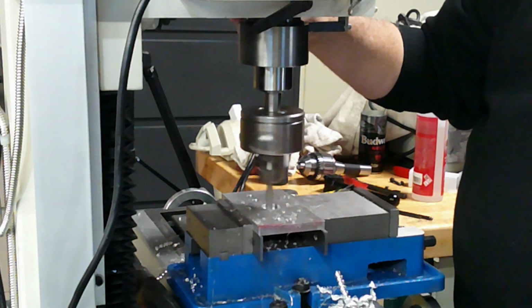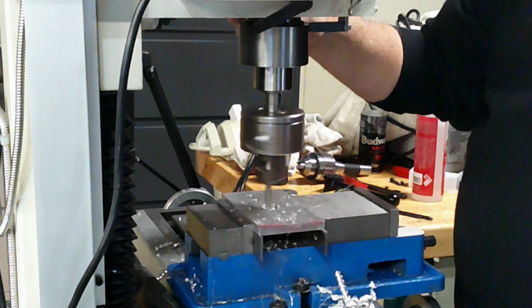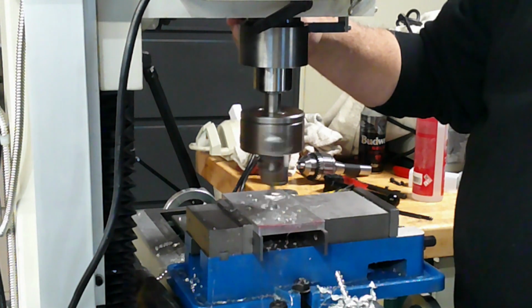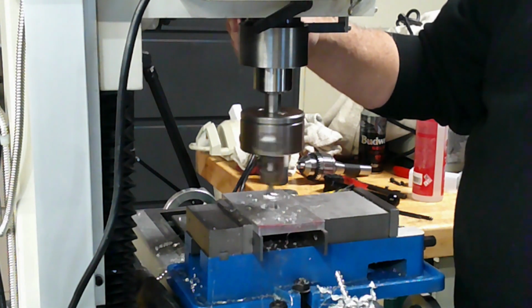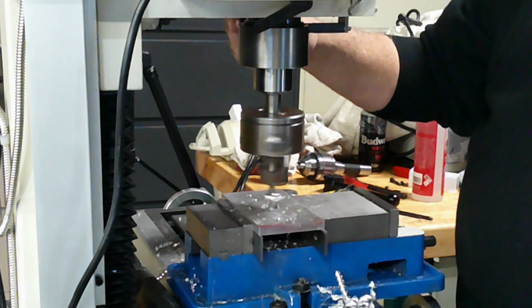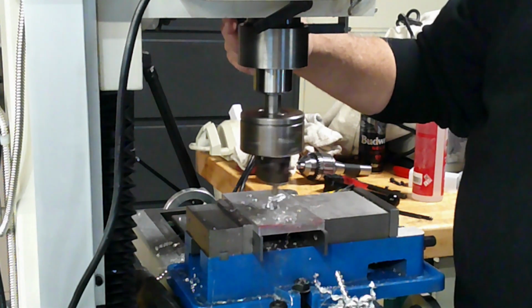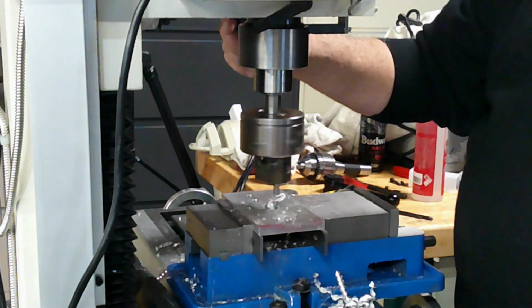The boring head I'm using was about 75 years old and belonged to my dad. It was in really bad shape from lack of use and abuse from others who got it before me. The bar holder was frozen and would not move, and as a result, the dial screw would only move about a quarter of a turn.